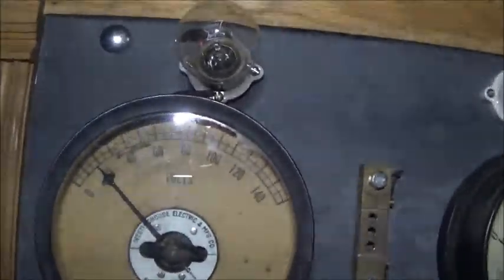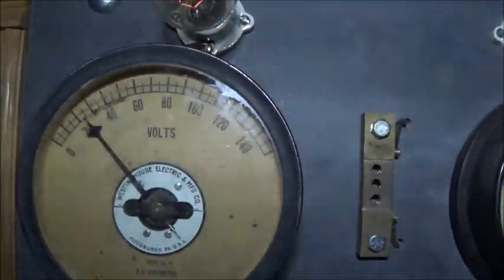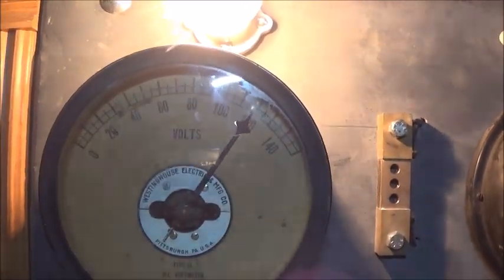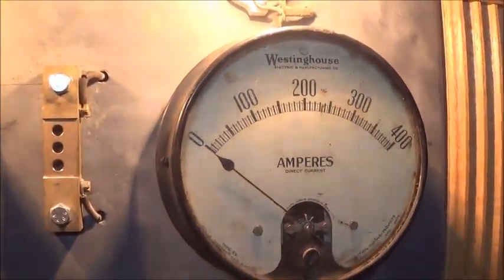Back down on our rear stack - we're making 5 volts. That's our field back on the rear stack, you can see it's gaining. Bulbs coming on, gaining. Oh, sorry about that - didn't want to get past 120. Okay, a little touchy there, there's 120. Now we're going to bring our power up. I don't know how many lights we got running - doesn't help that we got a street light right here.